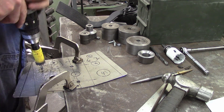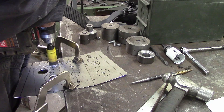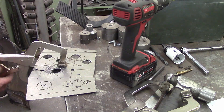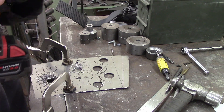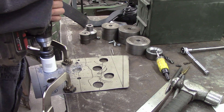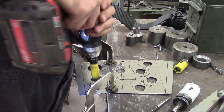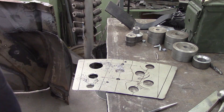Using a hole saw, I pre-drilled a quarter inch pilot hole just as a guide, and then hole saws. When you're using a hole saw, these are designed for wood - I'm not cutting wood. So you want to be kind of gentle. I tend to run these hole saws through steel until all the teeth are gone. It's surprising how far you can push these hole saws before they're finally no good at all. I've got a bunch of sizes for my dimple dies, and you can do them in a hydraulic press, plus this metal's thin enough that I just do them in a vise.